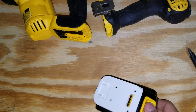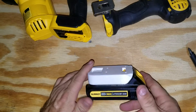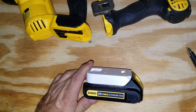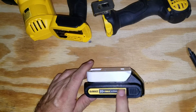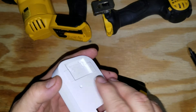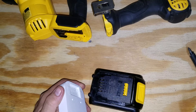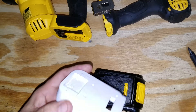Field Day is coming up, I think June 17th. A one amp-hour DeWalt battery will give me a lot of power for a long transmit and receive time. I used to use nine-volt batteries, but I'm going to use a resistor to drop the voltage down to probably 13.8 or 14 volts, and we should get about one and a half to two watts out of the Pixie transmitter.